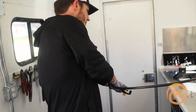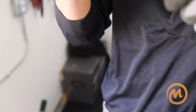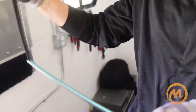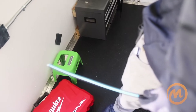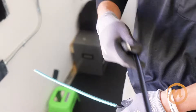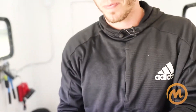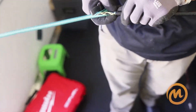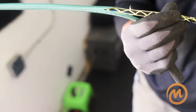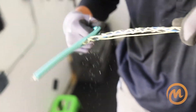Use your blade again, and just like the first sheath and first jacket, peel back, same on the opposite side, then peel your armor. Right here it's super easy when pulling this off to twist the buffer — you could either kink or cut the buffer on that aluminum — so you've got to be extra careful there.